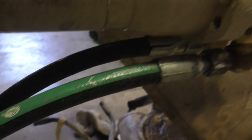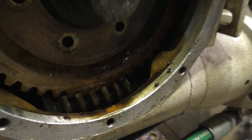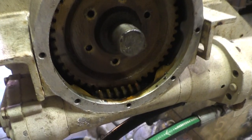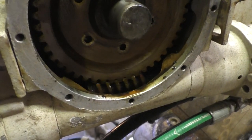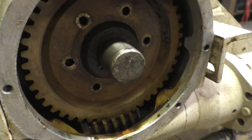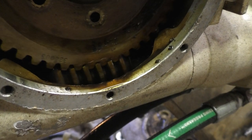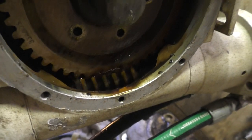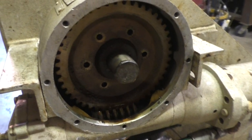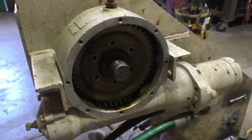So all we did is we hooked up our little pump here directly into the motor that drives the worm gear. So now you can see how a worm gear works. Now the really cool thing about worm drives is you cannot pull on that cable hard enough, or try and rotate this shaft hard enough, that it will make that screw turn. It just will not do that. The screw can turn the gear, but the gear can't turn the screw. So it automatically locks up.